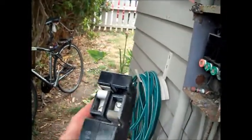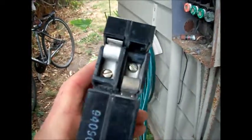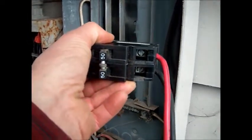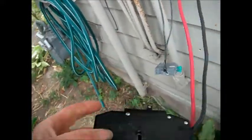If we look at the old breaker, we can see that this breaker is fairly well corroded in there. It has corrosion on both sides of the connection. When I tested the voltage at the black wire, we didn't have any voltage coming out of it. That is pretty well corroded up, and in combination with a worn bar, we could have problems — and we did, because we weren't getting 220 volts at the socket. Only one of these legs was hot coming out of here.